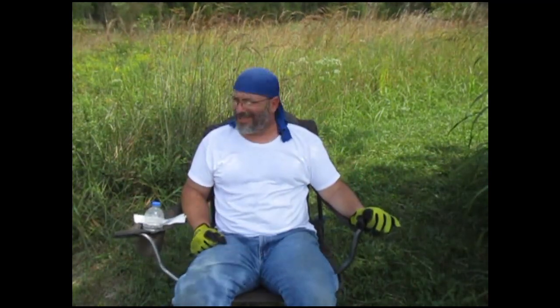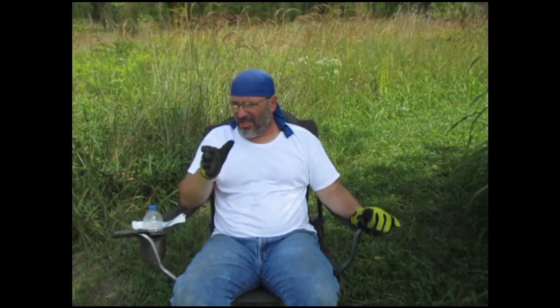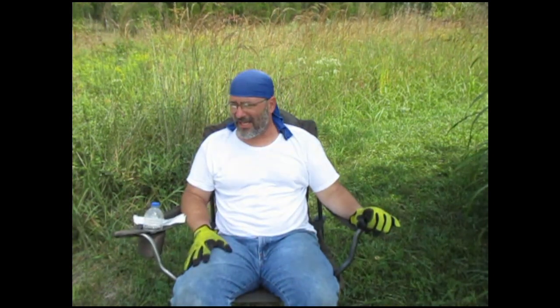Okay, well, my generator wouldn't start. I thought, well, this could be a little low on gas. So I filled it up. It starts for about 2 or 3 seconds and dies. So I thought maybe it was the oil shutoff valve. So I checked, the light wasn't on. I checked the oil and actually there was so much a little came out. So I cleaned that up, screwed it back in, plenty of oil.